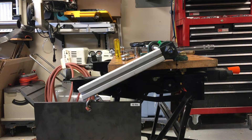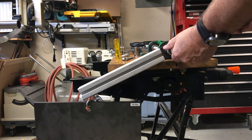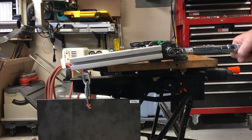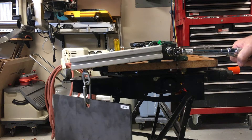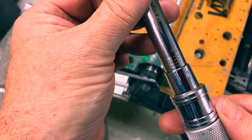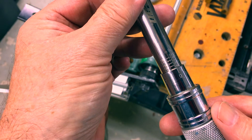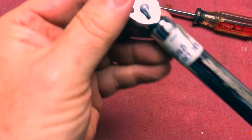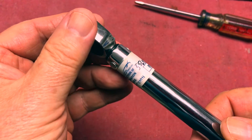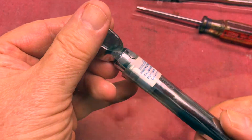Going down to 10 pounds of weight, I can check the quarter-inch drive wrench for 100.9 pound-inches. It's clicking off, but at a 110-pound setting. So I could just use it and compensate for the calibration error. I bought this wrench on eBay. While it has a calibration label, it doesn't mean it's calibrated.